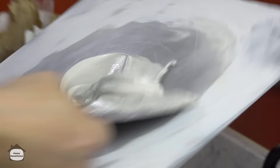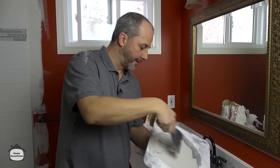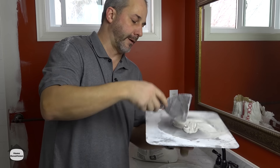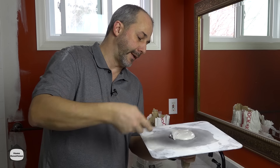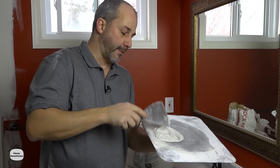Use your four-inch knife and just work this in. It's more of a paste now — you just want to flatten it out, make sure all your bumps are out of there. The smoother this is when you put it on the wall, the easier it will be to finish. Now, this drywall compound has a hardening agent that's chemically activated, and anybody who knows science knows that when you add heat to any chemical reaction, it speeds up the reaction — that is why we are using hot water.